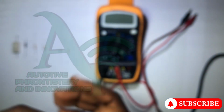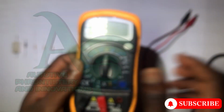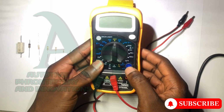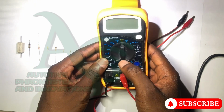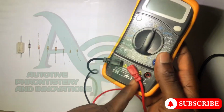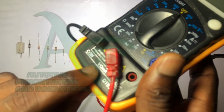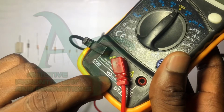Okay, so let's go into what we have today. Now you have your multimeter with you. If you've not watched our tutorial on how to make use of a multimeter, please do well to watch it. I have included the link to that video in the description of this tutorial. Okay, so we have our multimeter here. Remember to connect your black probe to where you have the common and your red probe to where you have your resistance symbol. We have V here. Take note, we have V and we have the resistance symbol, which is ohms here.